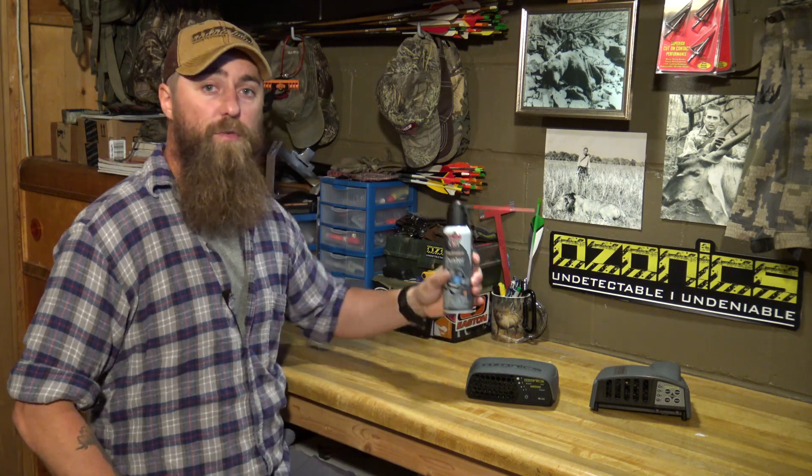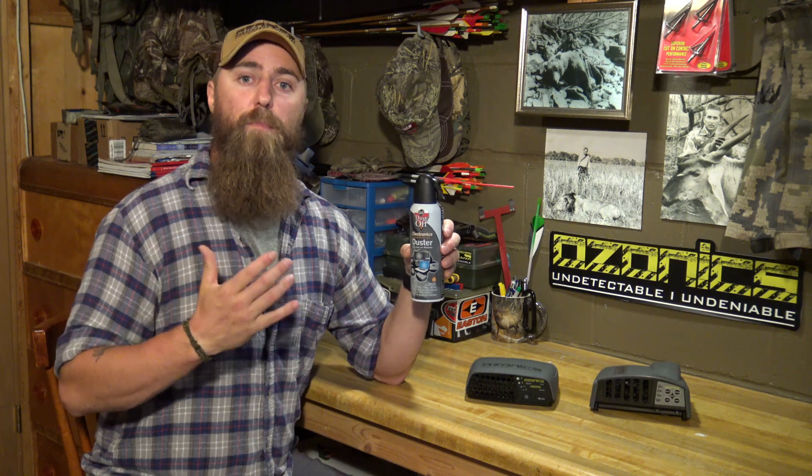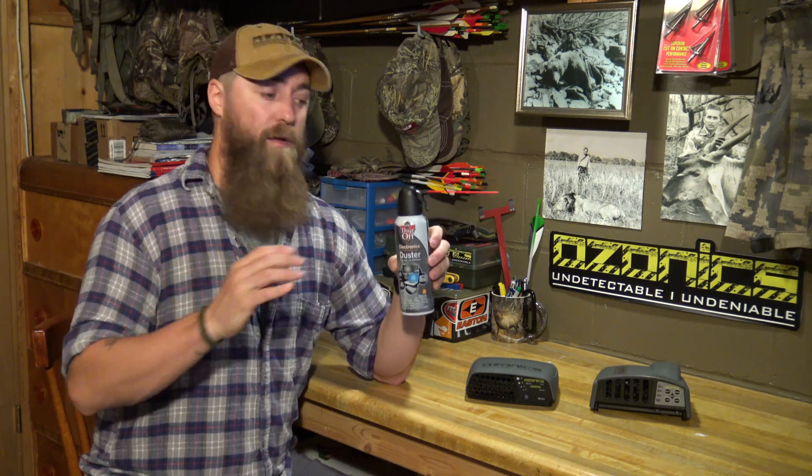This can happen more quickly in extremely dusty or high humidity environments. To combat dust and debris on the internal parts of your HR unit, go to an office supply store and buy a can of compressed air. I'd rather you not use the air compressor in your garage, because there could be a lot of moisture in the line. The great thing about these cans is that it's moisture-free air. If you start spraying moist air inside that HR unit, you can really do more harm than good.